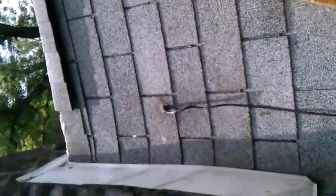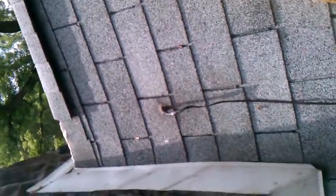What the home inspector saw was basically a wire coming out of the roof, which should never happen. What I'll do is clip that wire off, slide in a piece of flashing, and then it'll be sealed up. Another thing he saw was what they call counter flashing - which actually is not counter flashing. I basically call it filly flashing, because it's the cheapest thing you can do. If you don't have the skill to actually do counter flashing, this is what you do - you do filly flashing. This is for people that don't know exactly what they're doing.